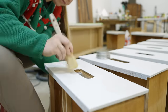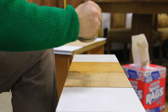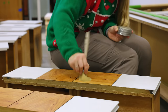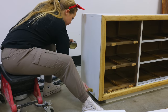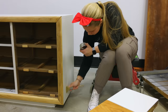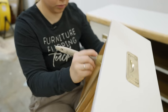I finished off the piece by adding a lemon-scented furniture salve for protection across the paint and the raw wood areas. I also used the salve to butter up the slides so that the drawers would slide smoothly in and out of the piece.